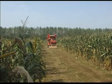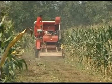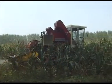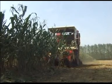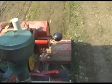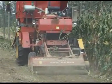6. Feed quantity of the harvester is limited. Harvesting speed is different according to detailed conditions of crops. Therefore, we should firstly apply low speed and increase the speed slowly. Operators should control handles flexibly and make sure that the cutting machine is suitable for the field.